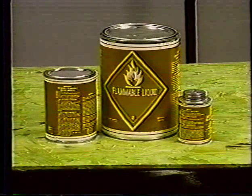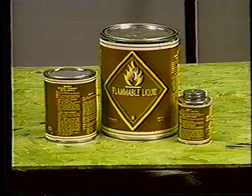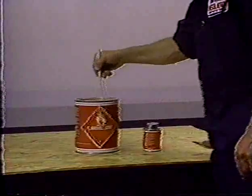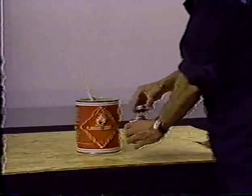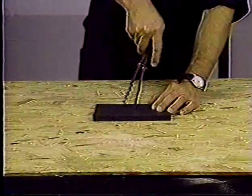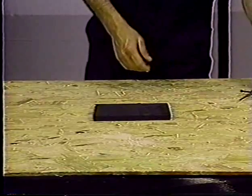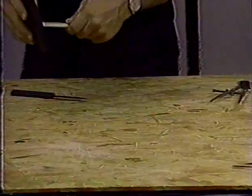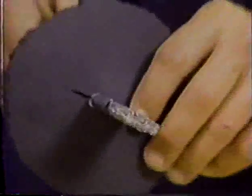Before we get into how to make fittings and deal with pipe hangers, some tips on proper use of contact adhesive to make tight joints. Most of these adhesives are flammable, so no smoking or sparks around them. You must always stir them well. Some have a brush in the lid and others open just like paint cans and you can use a stiff short bristle brush of your choice. To keep the adhesive from drying out and having a handy place to keep the brush, cut a doughnut from a piece of scrap sheet. Poke your knife through the center and push the brush handle in the slit.